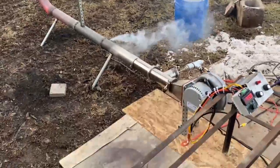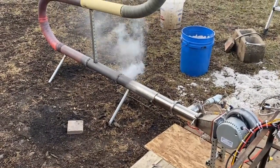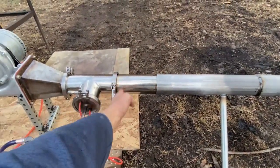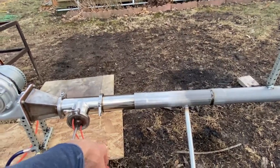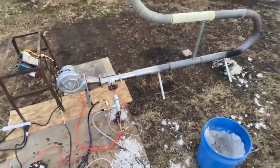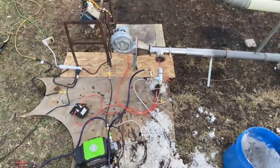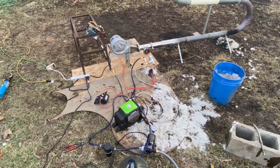It's going to need a bigger nozzle, from what I can tell — one of them big old two-gallon-an-hour nozzles. When this thing is set up in a furnace environment, all the way up to here we'll be in a red-hot environment, so we're going to be running a lot differently in a natural setting. That's kind of unfortunate that we didn't have some way of heating this area the way it would be in real conditions. Nonetheless, we did prove the concept that this particular setup is a viable application for a tube burning system and a heat treat process. The main premise of this was to convert from natural gas to a liquid fuel — waste oils and things like that — a cheaper fuel stock.